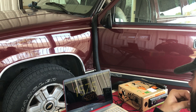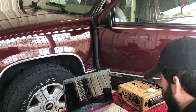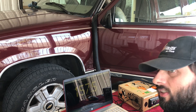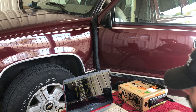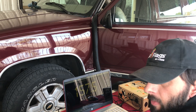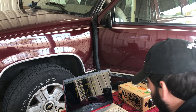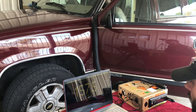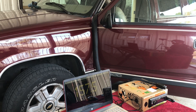The basic point I'm trying to make is: to get up higher in power, the 3 dB double-your-power theory no longer applies. I bet if I went up to a 161, it would take me every bit of 10K watts to do a 161, which is probably about right. That's why efficiency is so important — because as you get up into these decibel levels, you can't just say I'm doubling the power so I'm going to get 3 dB. That's no longer the case, as you see right here.